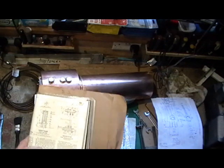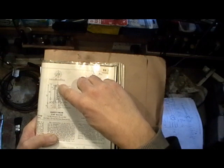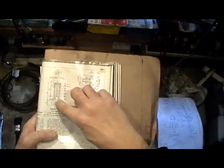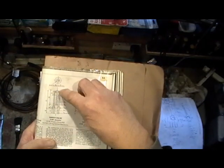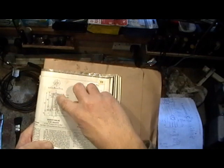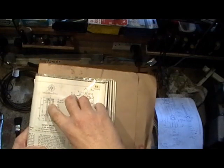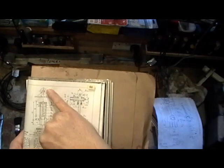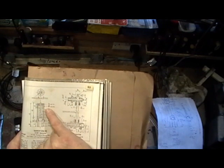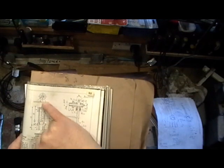I've got my components there ready so I thought I'd make a start on these. It's a body with a spindle in the middle and a ball underneath it, and the spring sits around the spindle. Then there's a cap that screws into the top to adjust your tension on your spring to give you your working pressure. There's a thread on this end that fits into the boiler and an internal thread at that end that the adjusting cap fits into. I think I shall make the centre bit out of stainless.